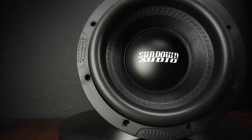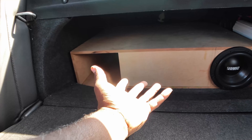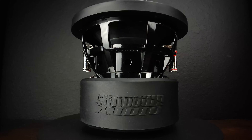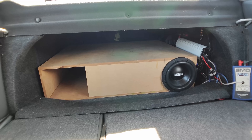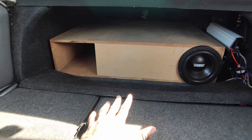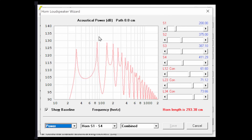This is strictly SPL. I know most horns are built for sound quality in terms of the horn itself. Originally, horns were made for home audio, but you can take an enclosure and put it wherever you want. In this case, we're going to be building this for SPL. Now, this does not have a flat response at all — it has two peaks, one around 80 and another one around 40 or 35 hertz. We are now in my car and we're trying to see what the peak value is going to be in this environment.